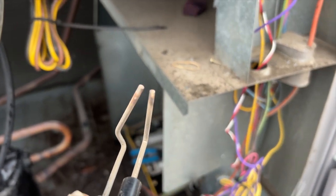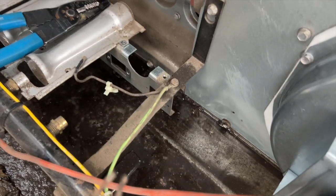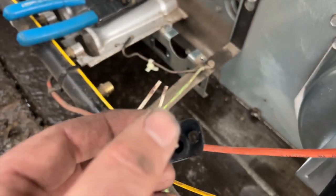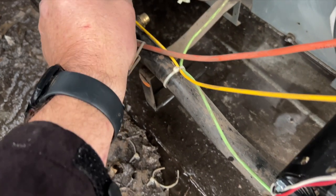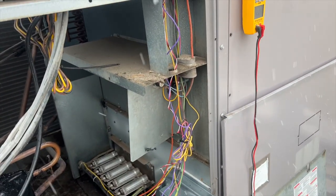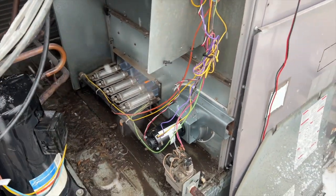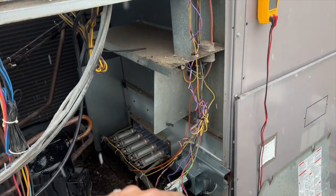The one time I don't clean it. I'm also going to check the ground - you see that brown wire right there? That's the ground. We want to make sure that's a nice clean connection because if it's not hooked up right, it's just not going to arc. I'm going to clean the igniter first. I think this ground wire might have been disconnected. Flame sensor and igniter are clean, burners are clean - firing. There we go, we're good to go.